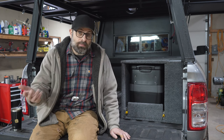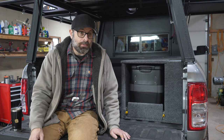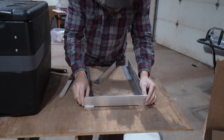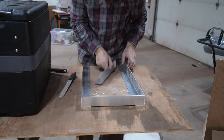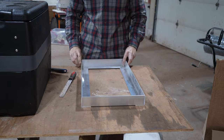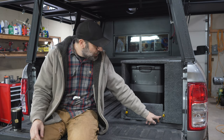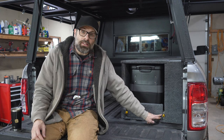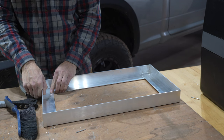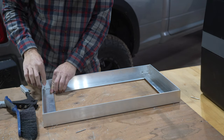Next thing: rivets. You need a rivet gun. They're not that expensive. You can buy a rivet gun and some rivets for $25 and you'll have it forever. I'll link a couple in the description. I used aluminum rivets. You can use aluminum or stainless steel. Stainless steel is going to be a little bit stronger. The cool thing about the rivet is you can cheat a little bit — I actually cut it so tight that I needed to cheat on one side. There's maybe three thirty-seconds of a gap between the two pieces of aluminum. How you set up this angle is important because it's all about support.